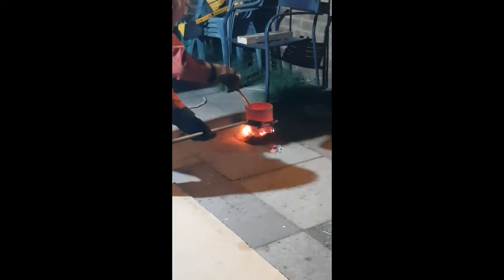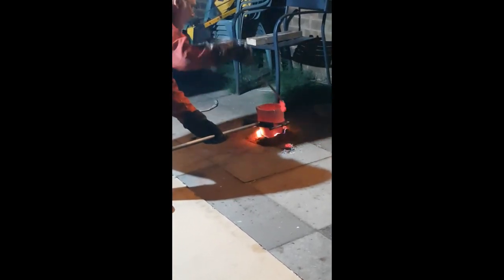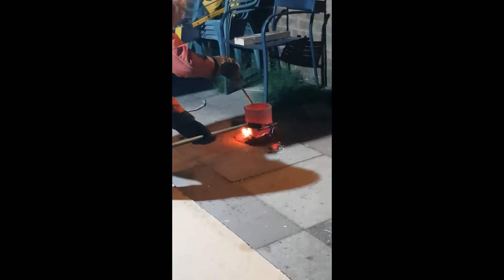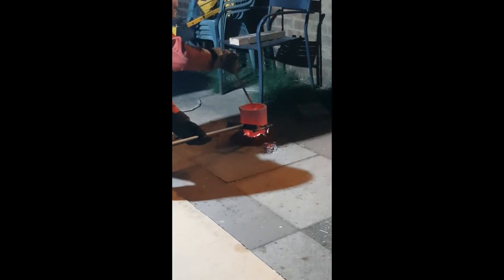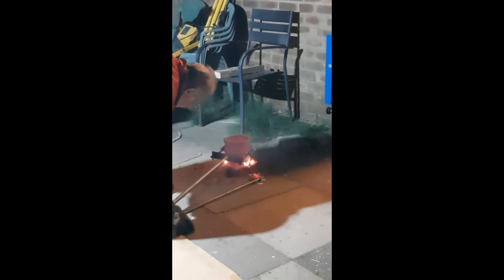This guarantees the strength and quality of the casting. The smelting process produces a quantity of oxides known as dross. This also must be removed prior to pouring so as not to contaminate and render the casting unusable.